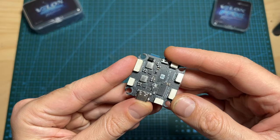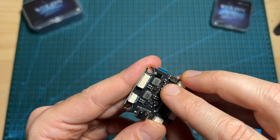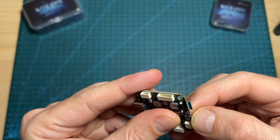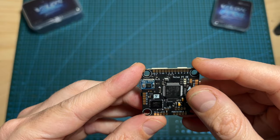In terms of features and specs, the T-Motor Velox F7 SE flight controller features a USB Type-C port, an F7 processor, 5V 2A and 10V 1.5A BECs, six full UART ports, a physical boot button, a Bluetooth chip that will enable you to wirelessly configure the flight controller using SpeedyBee's application, matching soldering pads in addition to a JST connector, an ICM 42688P gyro chip, and it supports up to 8 motors.